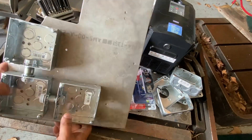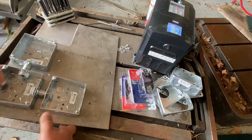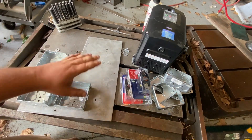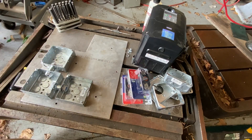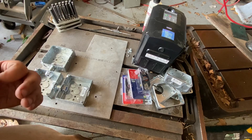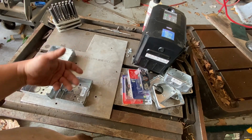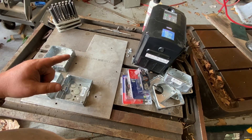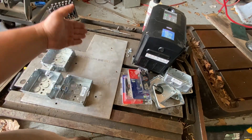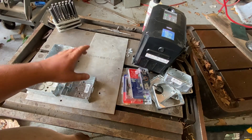Okay, so I got cleaned up, took all the sharp edges off there, cut that edge off. For projects like this it's function over form for me — I am so crazy busy right now, I just want to get this done. You saw me cut that with a hacksaw and I use the saw-zall over here. Be careful using an abrasive cutoff wheel on aluminum — aluminum can load the wheel and make it dangerous. They can overheat and shatter. They do make cutting wheels just for aluminum, so go that way even for small cuts. Flap wheels are fine for finishing, but be very careful cutting aluminum with any abrasive wheel.